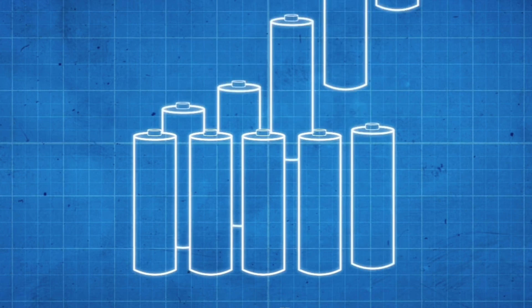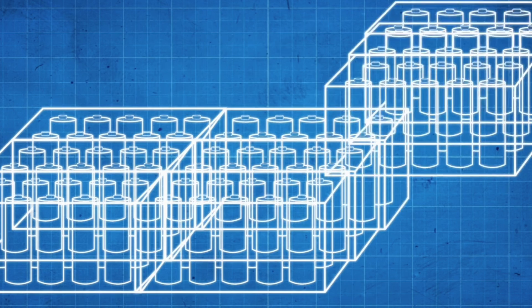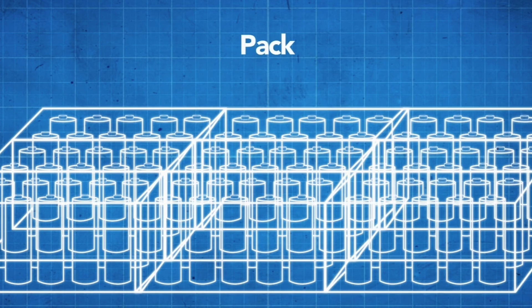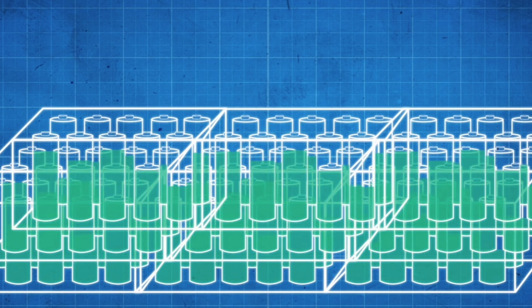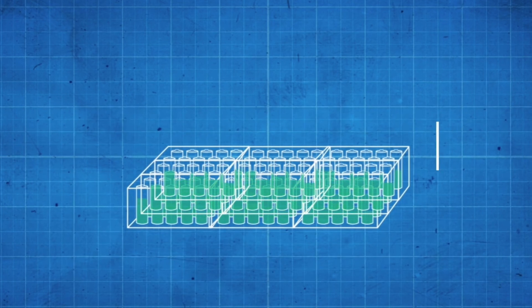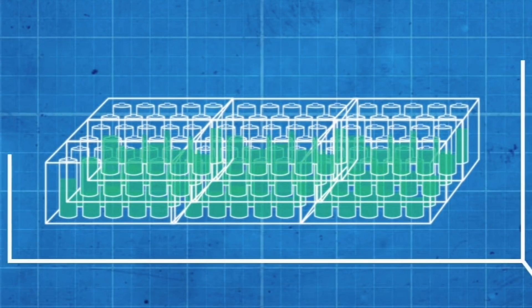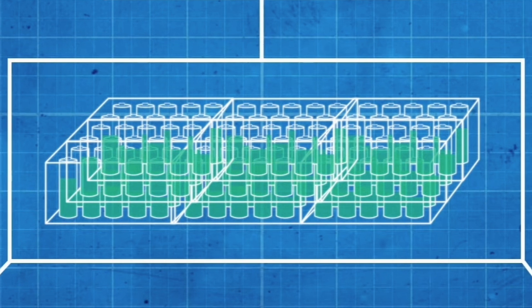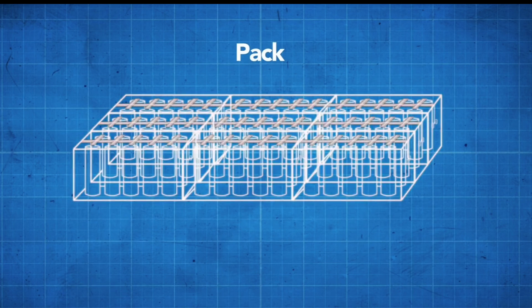The main functions of a BMS would be looking after battery safety, longevity, and monitoring state of health and state of charge. Various modules are built from individual cells, and cells are built into the pack, so it's very critical to make sure that every cell has charged and discharged up to a certain level, because the cell chemistries are slightly different and therefore it's impossible to have cells at the same level of charge and discharge. The BMS looks after that, as well as monitoring the temperature to ensure that the cells do not overheat and cooling the cells if necessary.